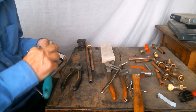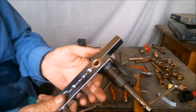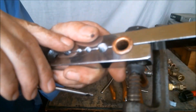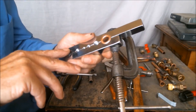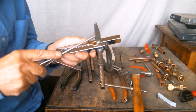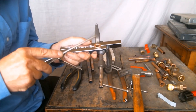We must scrape the surface gently with a file. This will produce dark and shiny surfaces, exposing any uneven areas. We must keep on hammering the shiny parts until the whole surface is shiny. We mustn't file too much, because hammering already makes the copper thinner.